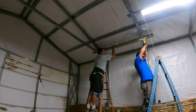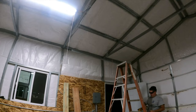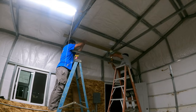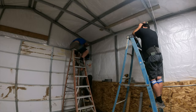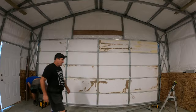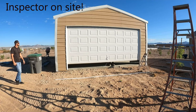I've got some green board I had from other purposes — I'm utilizing that to hang the track for the garage door off of. Here's the track going up. Above the garage door I had to put a two by six in there because that's what the spring mounts to. There's a lot of pressure on that spring, so the one two by six wasn't enough — I had to reinforce it because the spring tried to pull it right off the wall.